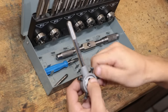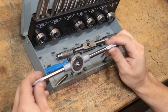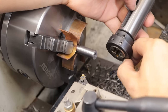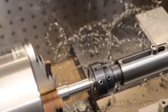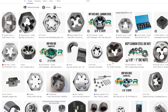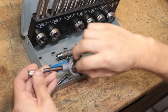The reason why I use three screws and end up juggling around at the end is because I'm screwing it all up by hand, and you need at least three to get a good amount of pressure on the die to lock it in place. However, when it comes to using the die holder in the lathe, I only use one - I can get enough pressure with a hex key. I could switch over to hex dies, but I already have three entire sets and it would be costly to replace them. So it makes more sense to stick with these dies and simply redesign the holder.